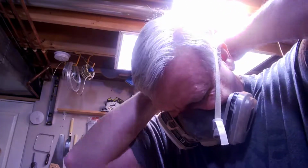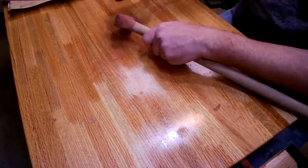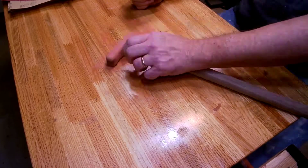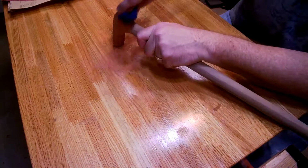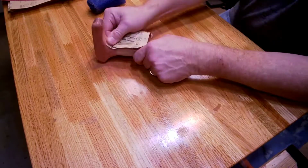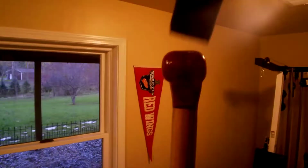And now for the dusting. So here's another shop tip. I wind up using 3M scouring pads, those blue scrubby pads that you saw at the beginning. I'll roll a couple of those together, and then I can put the sandpaper over the top of that, and it makes a nice soft way to get into the nooks and crannies, work around the curves. Anytime you push it down on the wood surface, it forms to the wood surface. And so after 3 coats of poly, it should protect it against the elements pretty well.